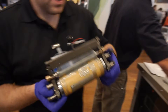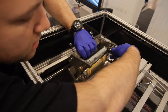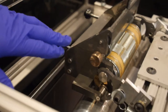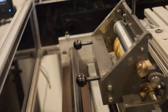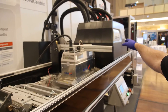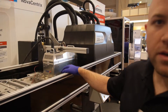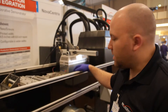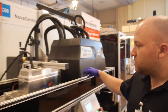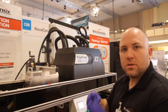After printing, we go straight to drying and then final curing. Here we have the ADFOS, which is a near-IR dryer — intense infrared light that removes water vapor from the ink. Then we have the PulseForge, which is a photonic curing system. The PulseForge 3200 uses a pulse of light to sinter the metal particles together.